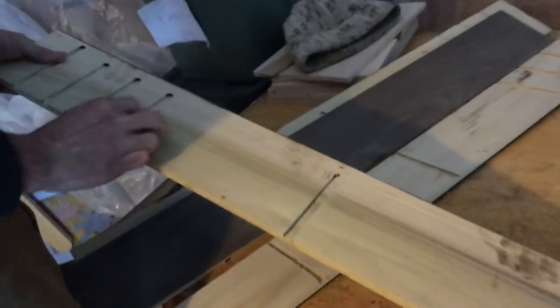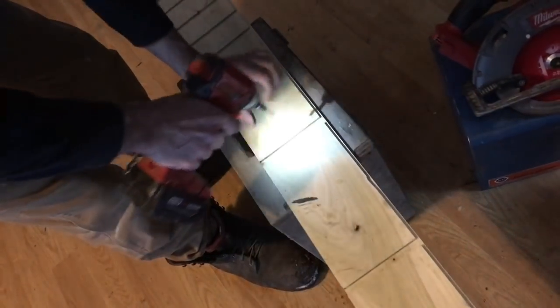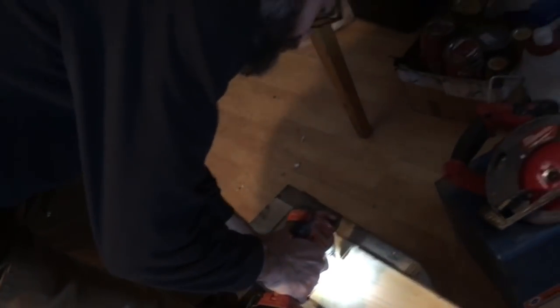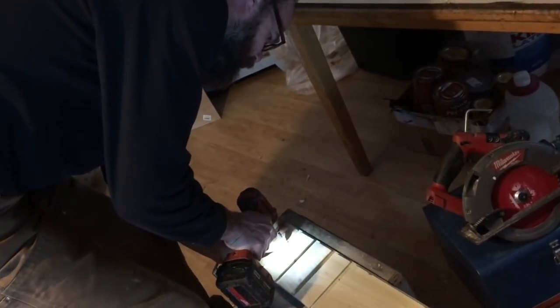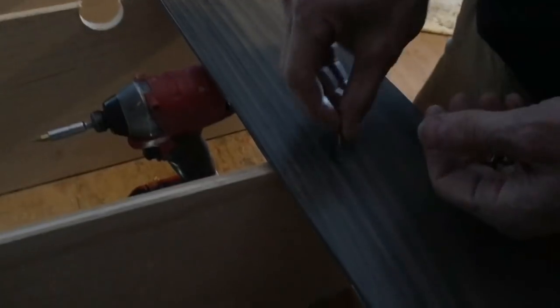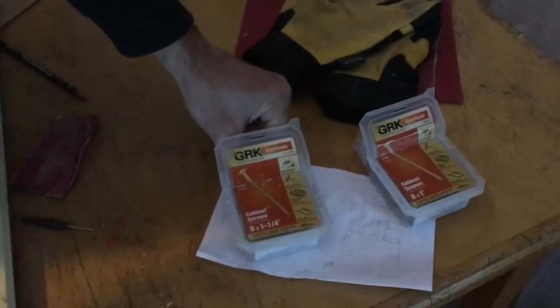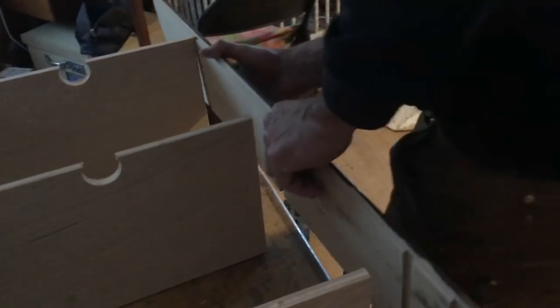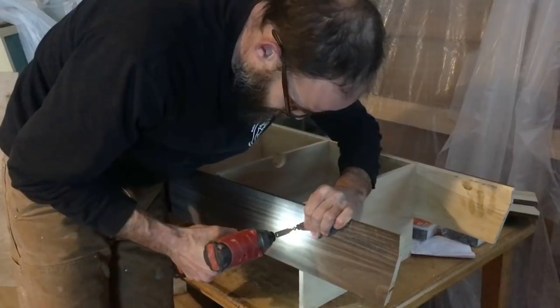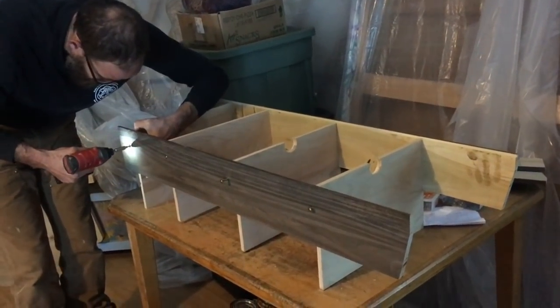So now I get to go inside. I don't mind doing a little hand sanding, hole drilling and whatnot inside the yurt. I still don't want to run the table saw in there. I like to pre-drill for screws using the dado as a guide rather than doing some marking on the outside and hoping it lines up — I can just see the center of the dado. Some pre-drilling for some cabinet screws. I like these little GRK cabinet screws. They're kind of tiny, but I like the big truss head on them. They really grab well and they're sort of attractive looking as well.